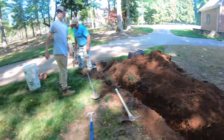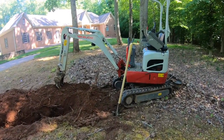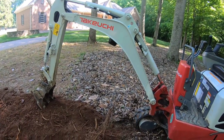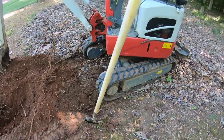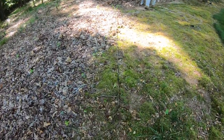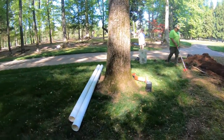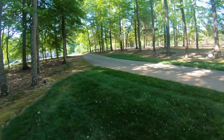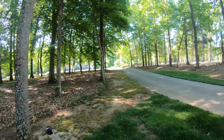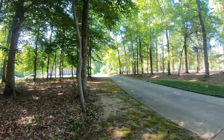Weston actually located the well pump and the water line — it comes through here somewhere at about 2.5 feet, so we're going to scratch the surface off and dig this by hand just to be sure. We also have another wire right here which goes to a little transformer pedestal box for the outdoor lighting on the ground. Even though the locators stated it was outside of the work zone, when you deal with this stuff, folks, you've got to open your eyes and see all the different obstacles that might be in front of you.